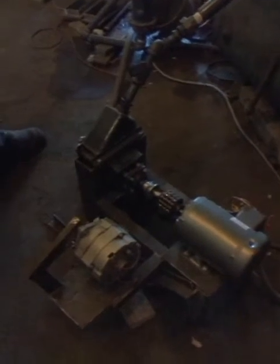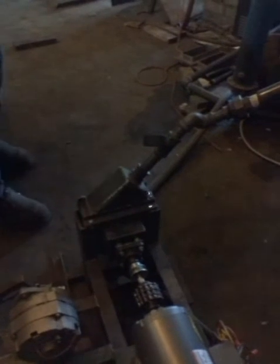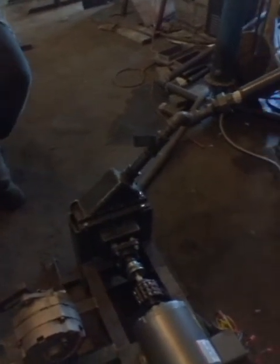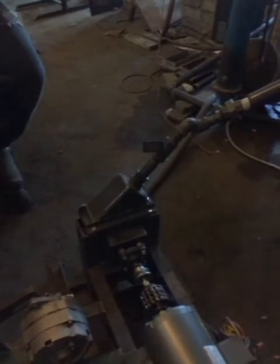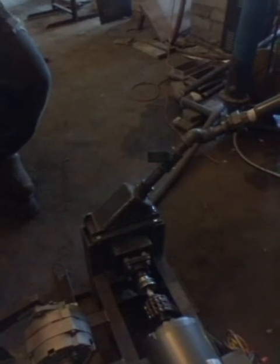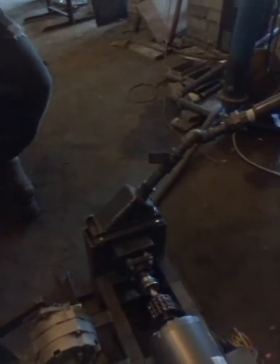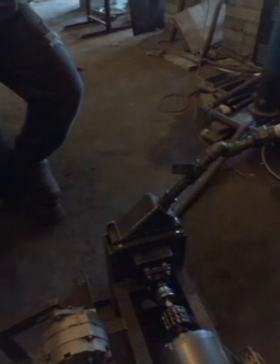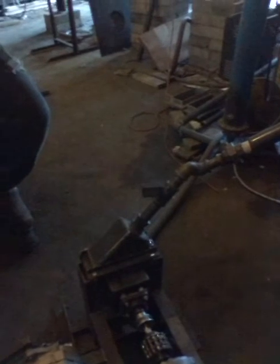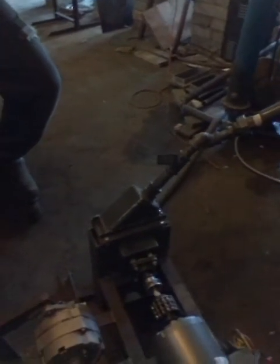Professor Rice had a turbine very similar to this. His turbine was seven inch diameter, had 11 blades, and was built in line with the Tesla patent. However, he did not use Tesla's nozzle. Instead, he used a pipe with a bunch of holes drilled through it that were perpendicular to the plate at a 90 degree angle. There was a good reason for that, and I want to prove what that was.